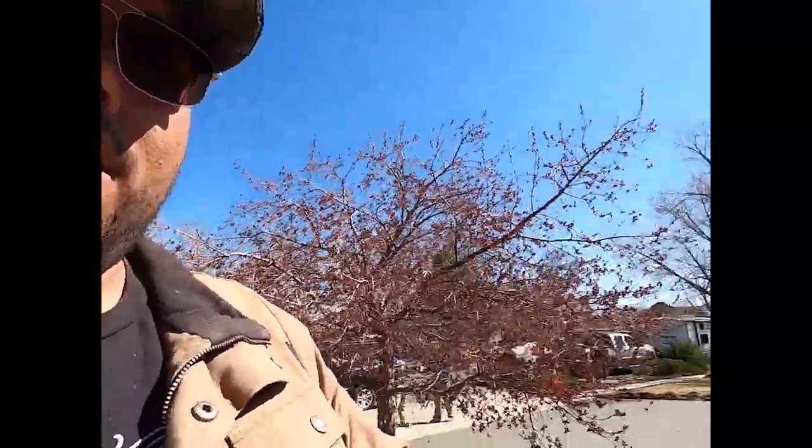There it is, guys. We're wrapping everything up. It's looking really good. Driveway came out awesome. Poured it early, poured it dry. We poured a 4,000 mix with fibermesh. We did number 3 rebar, 2 feet on center. We poured it 4 inches thick. Should be enough for any standard application. It's looking really good, guys. Let's go ahead and take a look at that.